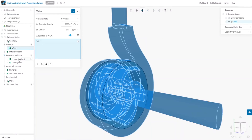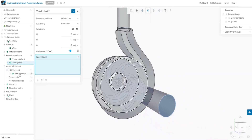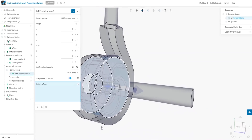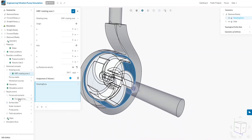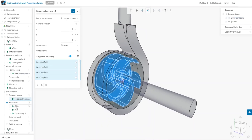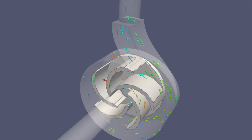After I designed the pump casing and the different impeller designs in CAD, these were imported into SimScale for analysis. We don't know all the parameters from the start, but that's fine because we can make assumptions and run different operating points simultaneously to see how the pump would perform across a wide range — for example, we can change the rotational speed, the outlet pressure, the flow rate, and so on. Once we have set up and run our simulations for the different impeller types, we can then compare the results.